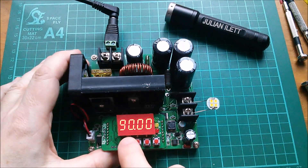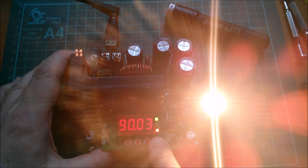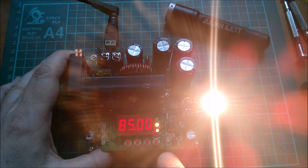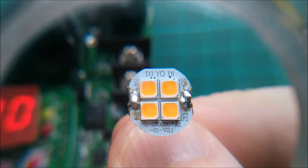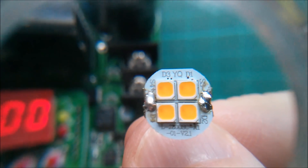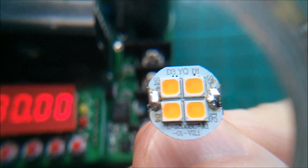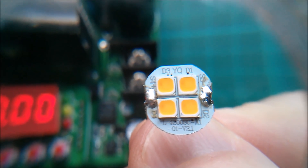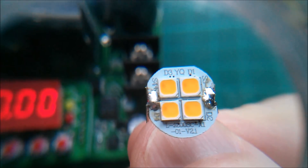This power supply is quite interesting. I've set it to 90 volts at 20 milliamps, and if I switch on - it actually goes to 90 volts in constant voltage mode. It takes a while for the constant current to actually kick in, then winds back to 84 volts. So for a brief period it actually over-voltaged and over-currented it. Interesting how slow that reacts. So yeah, this LED plate - it's got four what look like single LEDs on it: D1, D2, D3, D4. They must have more individual LEDs inside each of those little square chips, because it does indeed need something like 85 volts to light up. About 75 volts to actually start lighting, but 85 volts to get it to full brightness. Interesting. Cheerio, thank you.